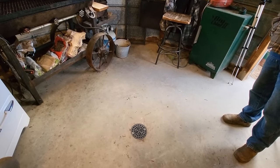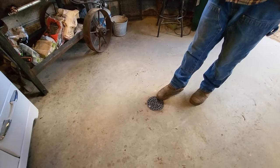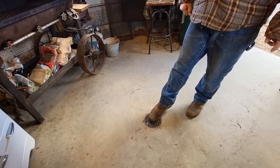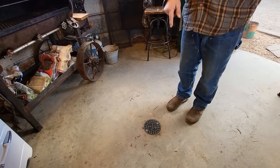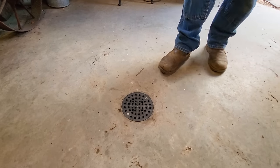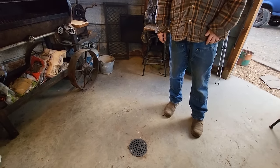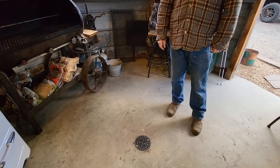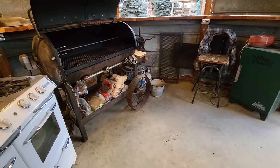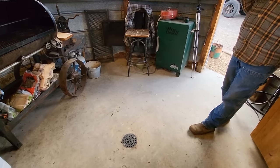It'll be fun to move, that's for sure. When I poured the concrete, I wanted it like a funnel — everything sloped toward the center. I used a center pipe with a French drain and drain rock. When I do up a lot of fish in here and make a mess on the floor, I just take the sink sprayer, spray the floor down, and sweep it down the drain. If there are any little pinhole leaks in the roof, the water hits the concrete and goes down the drain too.